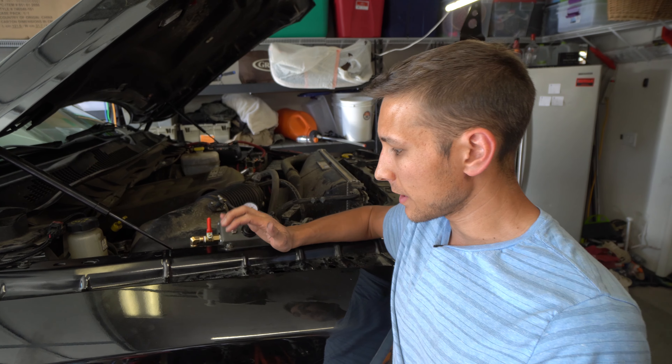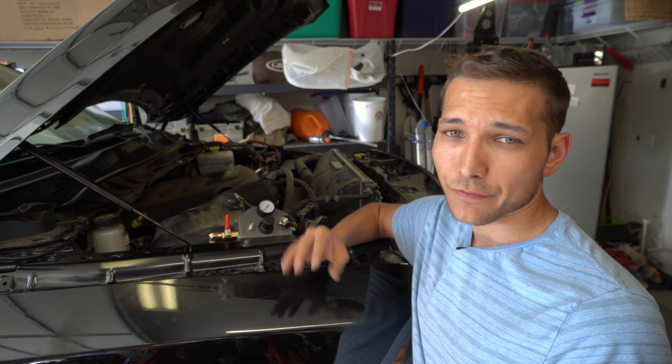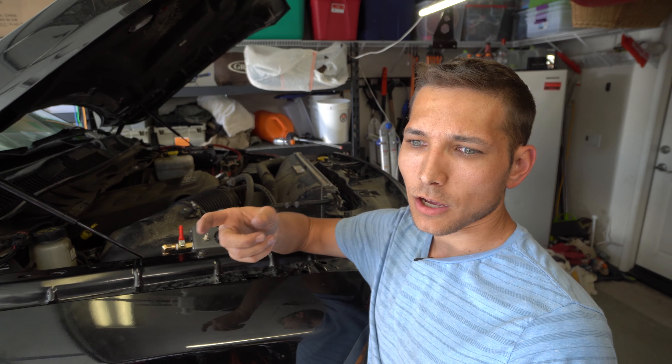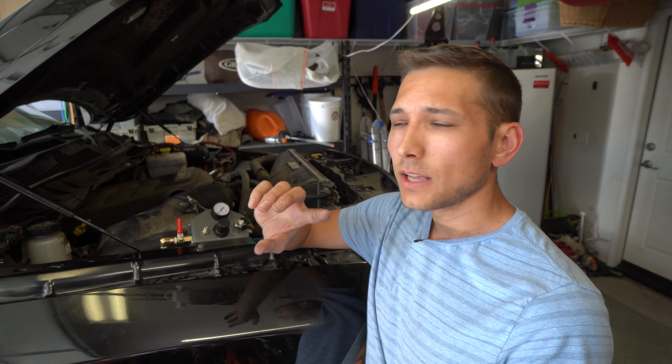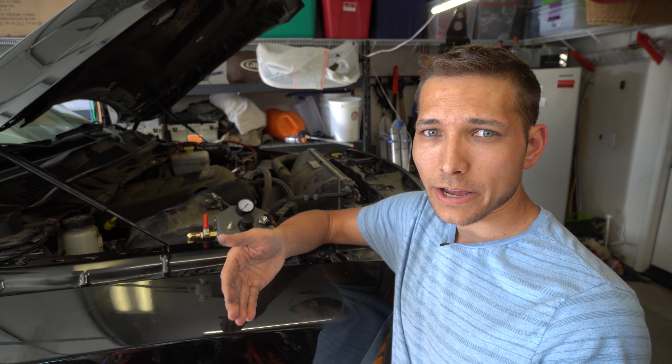The other thing I did for the compressor is I hooked up the fan to the on-off switch. So as soon as I turn the compressor on, the fan turns on. But it's on the positive side of the pressure switch, so that way when the pressure switch tells the compressor to turn off, the fan will stay on to help keep it cool — especially since I have it mounted upside down instead of the normal mounting orientation.